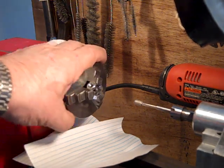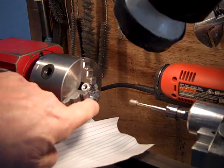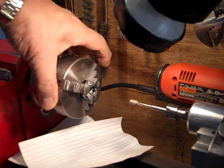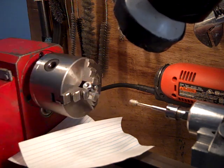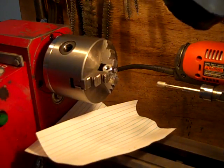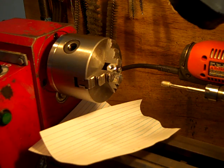I put bluing on there. I don't know if you can see from there, but that one hasn't been touched yet. That one just got touched, and that one's been ground in pretty much, and they touch more as you go in deeper — which is the opposite of what it should be. If there's going to be a taper to the jaws, it should be tighter on the outside than on the inside.